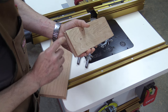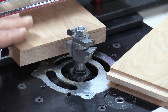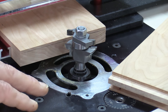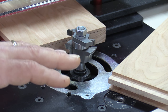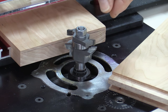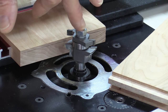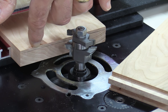I'm going to do the cope end first, so let's get the router table set up. I've got a test piece set up here in my coping sled and the router bit is installed. The piece is face down — you always want to make sure that the face you want to keep is facing down on the router table or coping sled. I want an eighth-inch rabbet on the back, so I've drawn a line at an eighth of an inch and I'm going to slowly lower this bit until the cutter wing just hits that line.